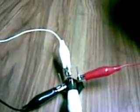There we go. Now, I don't know if you can hear this or not. I'll bring it a little bit closer. But that relay is oscillating on the inside. What's actually happening is the magnetic field is collapsing. It's coming down through these white wires into this neon lamp. Because I am running it through the battery right now, you can't see if the neon lamp is lighting up. It's not really lighting up at the moment. Now it'll go through these white leads into the bridge rectifier. Comes out of the bridge rectifier right into the top of the car battery.